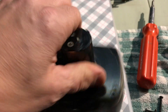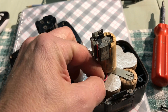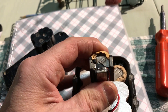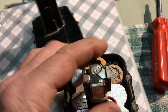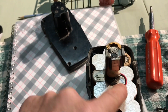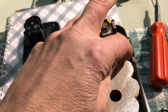In the same vein, I'm going to take this battery apart and do the same thing. I'm already taking the screws out. I'm going to take all the cells out and actually reuse these wires. If you put the cover back on, as with most batteries you can see where the polarity is — positive and negative. The red wire is positive and the black is negative. I'm going to disconnect it from the cells, get rid of the cells, and keep the terminal plate because it goes back into the housing.